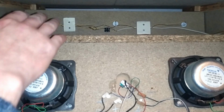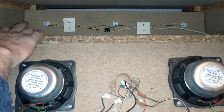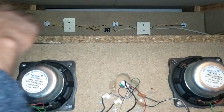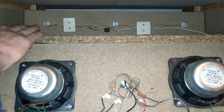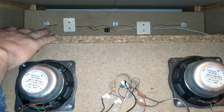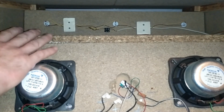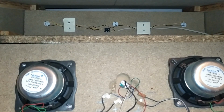So I told you before that I had 3 light bulbs, which you see there, the backs of them. And they're little kind of bayonet-y fellas, or they've got 2 little spikes on them, one positive and one negative. So what I did was I daisy chained the positive spike together and the negative one as well, and then I just joined them up to a 12-volt power source coming from an ATX power supply, which I'll show you there in a moment. And what happens is, as soon as I turn on the cabinet, 12 volts is supplied to those 3 bulbs and they light up immediately. There's nothing more to it than that. I have no control over it. When the cabinet's on, it's turned on, and when the cabinet's off, they're turned off. And that's as easy as that gets.